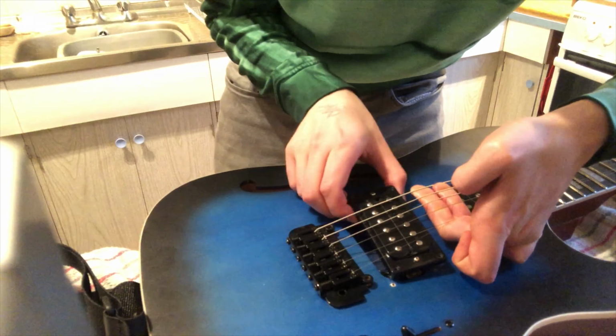So I think it's best if I use the soldering iron to unsolder these. Plastic fumes. Come on. There we go. That is lovely work. Don't blow on the joint. Doesn't matter because I'm desoldering, but it's a bad habit to get into. So, now they're unsoldered, I'm going to unscrew these pickups at the 4 corners on the pickup ring. I'll turn my soldering iron off for now because I don't need it.